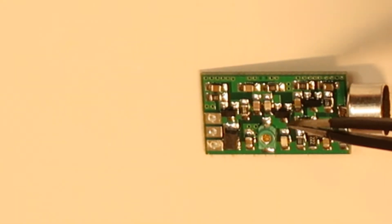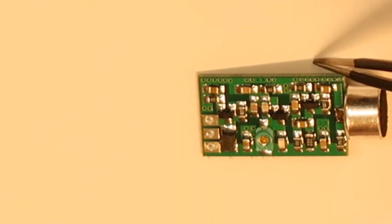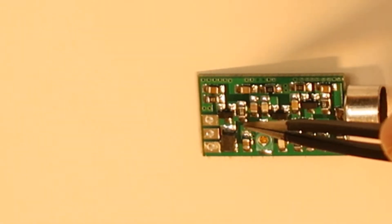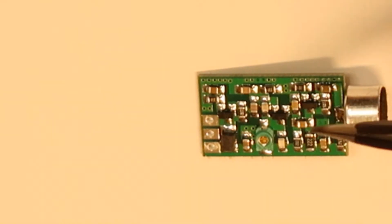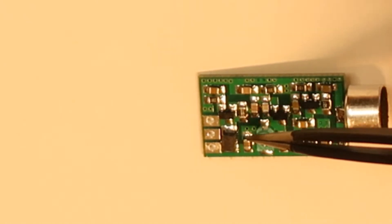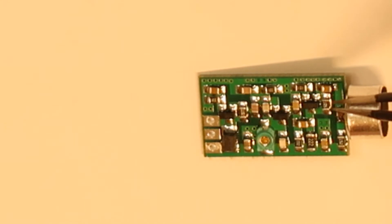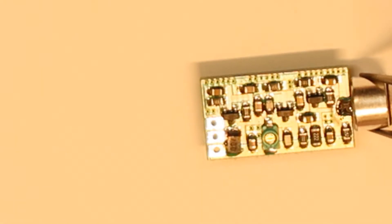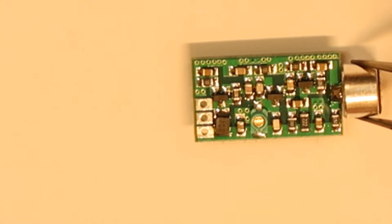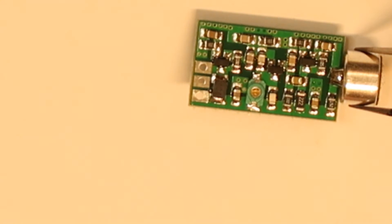You can see here there is a tiny capacitor that you can use to change the frequency with a screwdriver — preferably plastic, but metal works too. Then you have another stage which is the antenna. You have an LC tank here — probably this is the coil and these are the capacitors. So you have the main RF frequency, and when there is sound it changes the main frequency a little from side to side. This is how FM is transmitted.